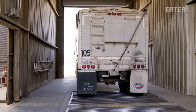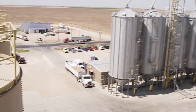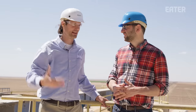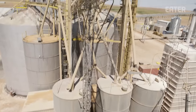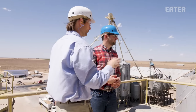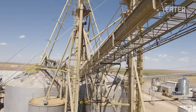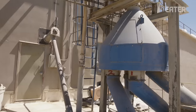Panhandle will store the wheat in one of 17 silos, where it can be held for up to a year until the factory is ready to process it. Because we're right at the end of wheat harvesting season, all these silos are going to be full, but by the time the trucks start rolling in again next year, they'll be mostly empty. We're standing on top of the roof of the flour mill — you can see all the bulk storage for the grain and the elevators. One of the reasons they use elevators is to bring grain up high and then use gravity to let the process flow downward. This conveyor brings wheat from bulk storage over to the mill — ready to start the milling process.